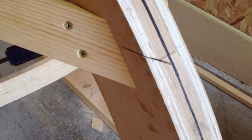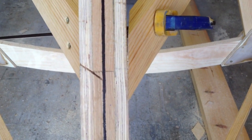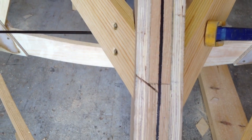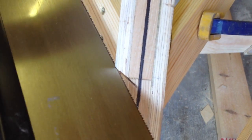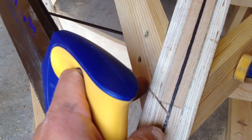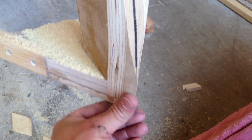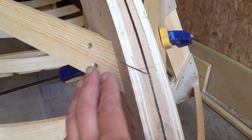As you can see it needs to come back quite a long way to make it all line up. The way I work out whether it's back in far enough is just by cutting a little slot here with the tenon saw. This black line here is the centre of my stem, so I just run a tenon saw through the stem like that until it comes flush with the chine along the length of the blade. You can see that when that meets up with the line in the middle, that means your stem is going to line up with the chine once you've fed it all down — because eventually it's going to look like this all the way up. So that means that one's in the right place.